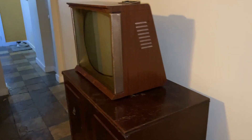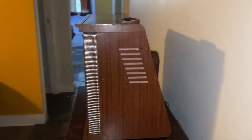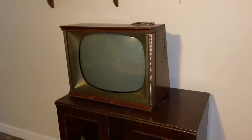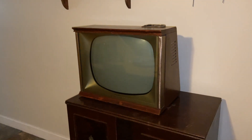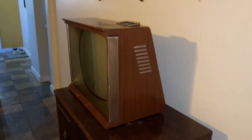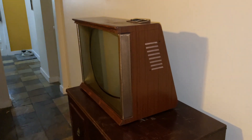I had to get a CRT for it. I had to identify that it had the oddball 9060 chassis, which I was able to do after I figured out the model number for this set. From the Predicta brochure, I was able to cross-reference it with the SAMs, which shows the models that had the 9060 chassis — this being one of them. I also found an internal document from Philco that showed this set with the back off, confirming the 9060 chassis.